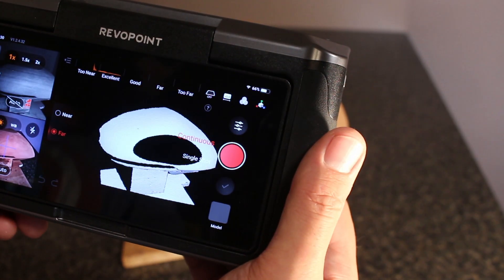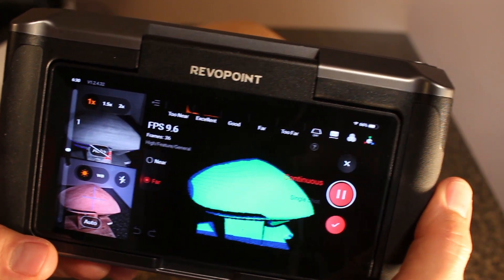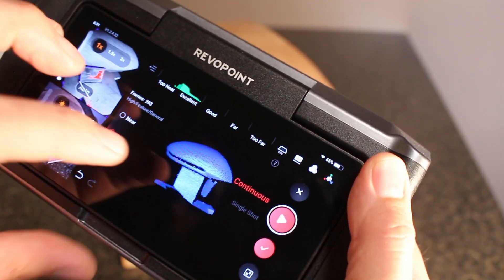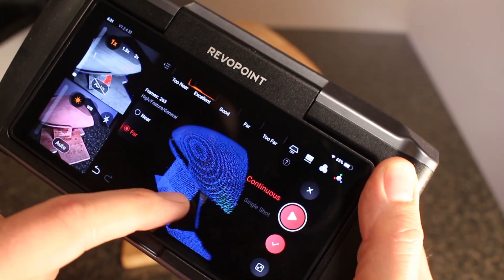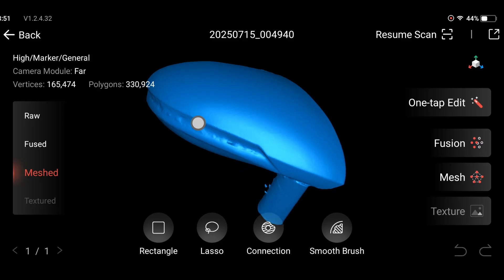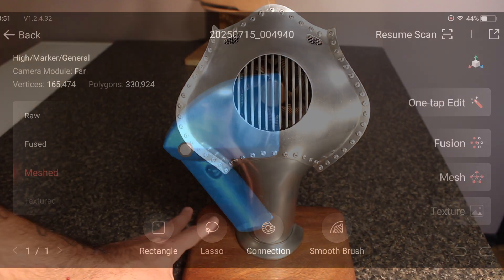Now this one, if you look at the top there where it says 'too near' and those red bars — you don't want that. I was doing this wrong when I started. I still got a decent scan out of it, but it was too close and it wasn't scanning properly, so the resulting scan was a little bit muddy. This is the resulting scan and as you can see there's a lot of little flaws in it — it just didn't catch all the details the way it should have. So make sure that those bars are all green.